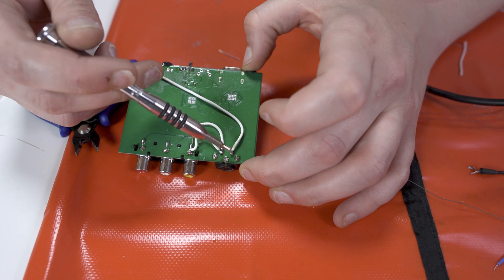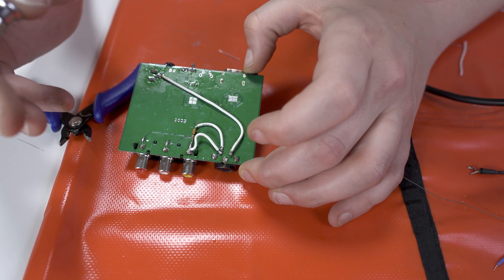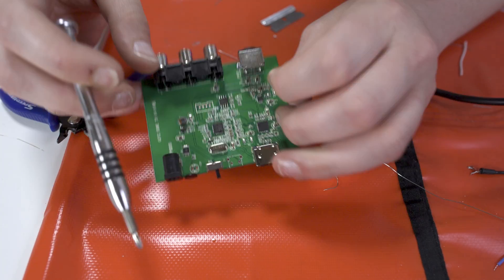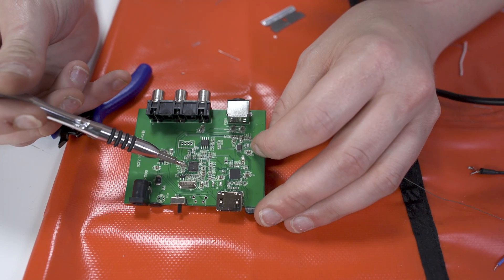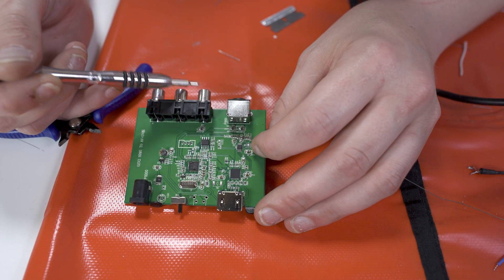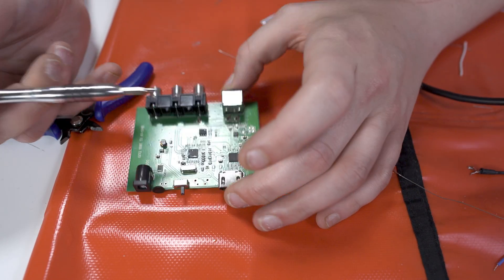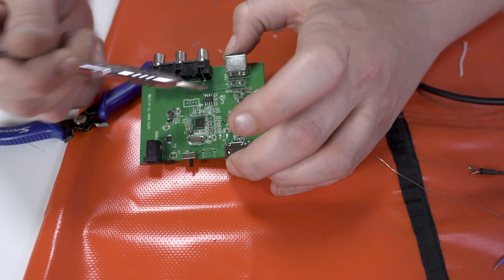What was going on with the S-Video is that if I measured the ground, it was something like 500 ohms, which is crazy — that's not a ground. We properly grounded it and by putting the resistor here we brightened up the picture. Now this isn't going to be as good as if it was actual proper S-Video. If we look on the front here, we can see the S-Video connection is going through this IC here and separate lines are going to the S-Video output. My guess is that these resistors — actually it's a capacitor and a resistor and then another cap — my guess is they're incorrect, that's why the picture is all screwy, or there's some sort of interference in the circuit.